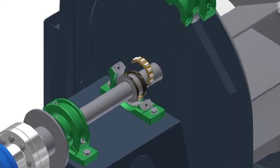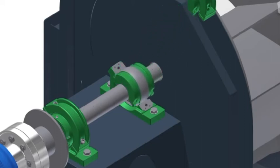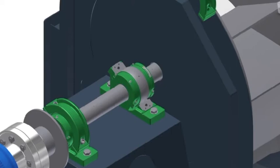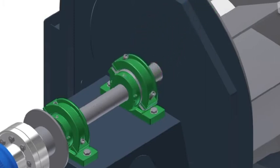The previous animation showed how the pedestal was already under the shaft. That's because the first time you install it, you'll have to disconnect all the drive equipment and slide that pedestal on the shaft. But when you have this angled pedestal, once you cut out your old bearing, you just slide the quick-fit pedestal under the shaft, then bring in the bearing components and get back to work. Between the split bearing and the angled pedestal, Timken Revolvo keeps your operation on the move.